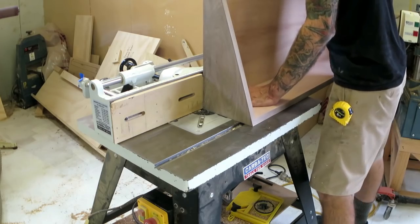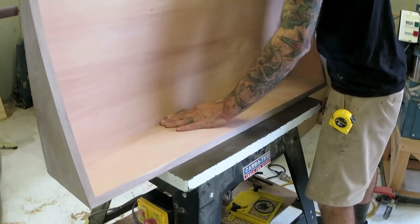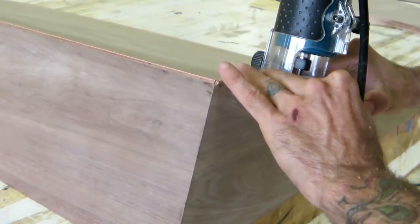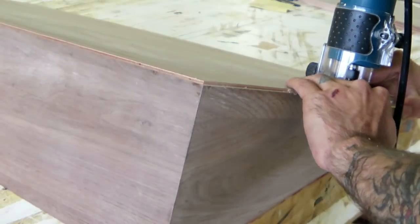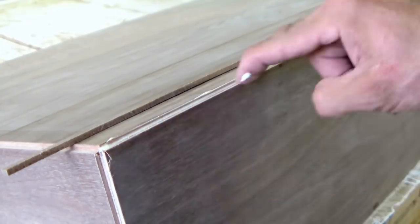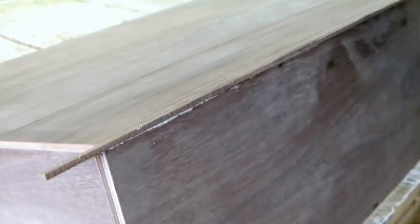And this is another bad idea. For some reason, it just made a terrible cut doing it this way, rather than putting the rebates around on the lid. So I ended up having to increase the size of the rebate to get rid of some of the tear out I had, and do it by hand with my small router. Once it was done, I could then glue in some pieces. I ended up using 3 by 4mm pieces.